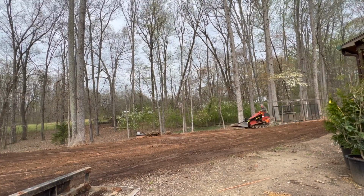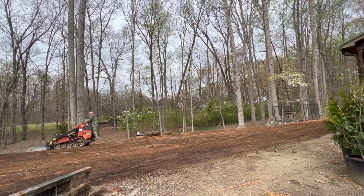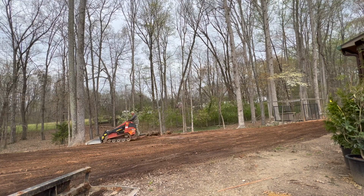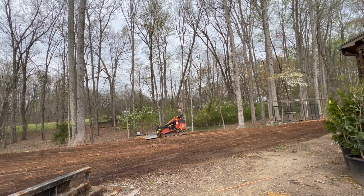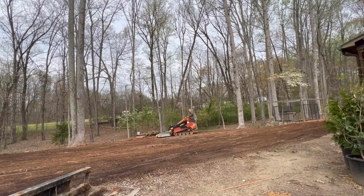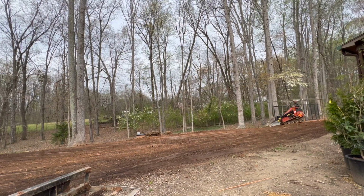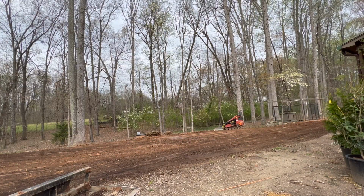What you want to be able to do is get your dirt loosened, rip it up, get you some loose dirt, something to work with, so you can push it around and get that dirt level. And then you do your back dragging to make it look pretty. That's what you want to back drag your way out of something if you really want to pat it down, make it look nice. But I remember my dad, me trying to learn how to run a dozer, and he said, "All right, boy, we don't want that fancy grading today. We just want it flat. We'll do that fancy grading tomorrow." I'd always remember that when I was about 13, 14 years old then. But anyway, hope you like this video. Maybe these little tips might help you out.